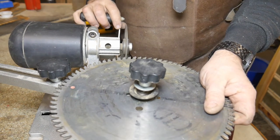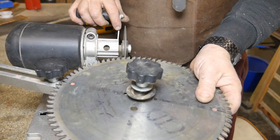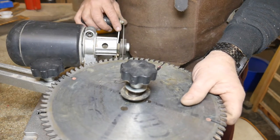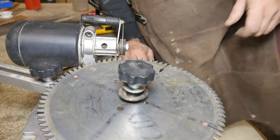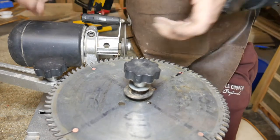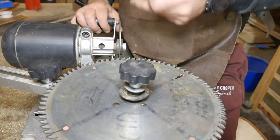Make sure you pull the disc right back before you move the actual blade around. Push it on, pull it back - try not to damage your gullet. As you can see, I'm using my hand on the left to actually pull the tooth onto the diamond-impregnated disc. When you've got a lot of teeth to do, it's quite easy to get carried away and think you're doing well, then you end up causing a problem by damaging your tooth. So I'm going to make another quick inspection using my torch underneath - I'm still happy with that. When you're pulling the tooth to the blade, you're flattening the tooth; there's a bit of give and movement which allows for any discrepancies. Make sure you release the pressure on the tooth before you bring the handle back.